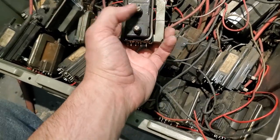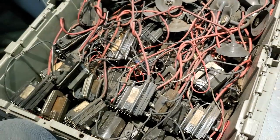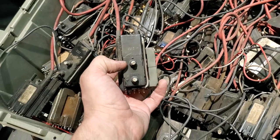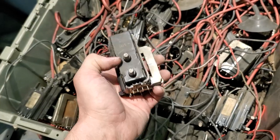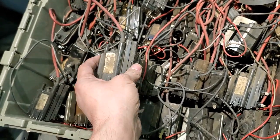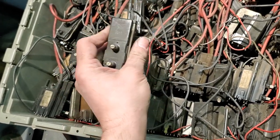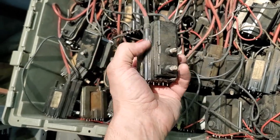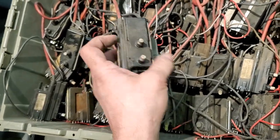The main reason these need to get swapped — especially if your games operate for more than a few hours at a time — is that when the flyback gets up to operating temp and then cools back down again, it's stressing the plastic on the flyback itself. That normally isn't much of a problem, but there are a couple things it can cause over time. Sometimes you can get arcs forming from cracks developing in the plastic, but the real problem is in the pot block on the front.